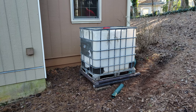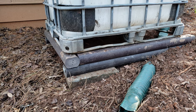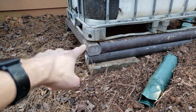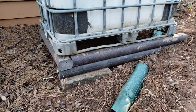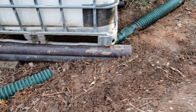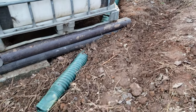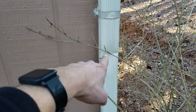This is what the rain collection barrel looks like so far, set up next to the house. We built a stand here to level it out, made of recycled plastic landscaping timbers with old concrete blocks underneath to support the load. It's on a hillside, so we've tried not to affect the hillside too much so water can still flow downhill underneath and not pool. We've passed the gutter pipe underneath, and there's also some drainage coming from behind the house that needs to be adjusted. Here we have the downspout for the gutter — there's already a break here which I'm hoping I can cut right there and make it look nicer too.